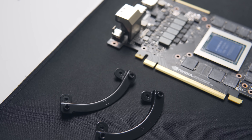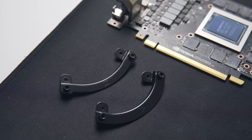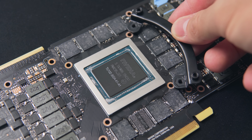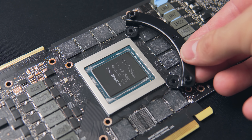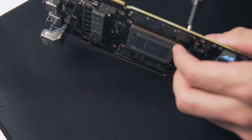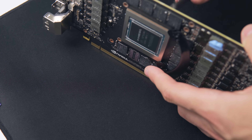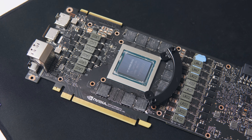First we need to install the mounting brackets to the PCB. Interestingly, the Nvidia mounting brackets for the 2080 Ti don't fit, whereas the AMD mounting brackets actually fit perfectly — the holes line up perfectly and the height turns out to be just right. Just to clarify, although these fit perfectly for the 2080 Ti Founders Edition, I'm not sure whether they'll fit other GPUs like the 2070 and 2080, or even other 2080 Ti models. Best to check online for your specific model, or just go with the Founders Edition like I have here.